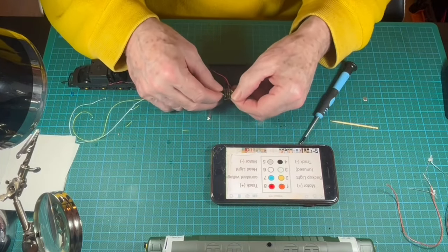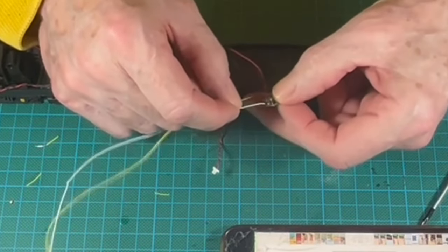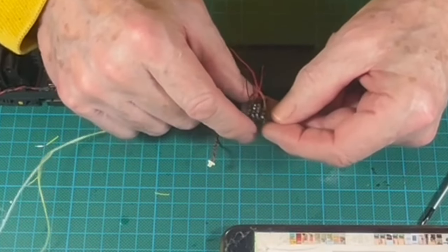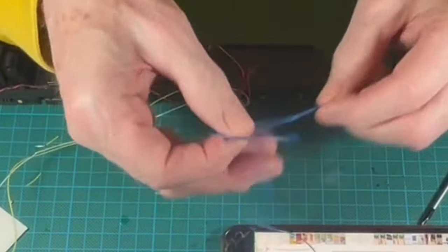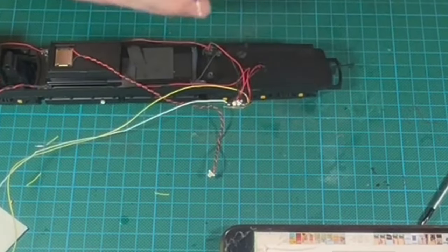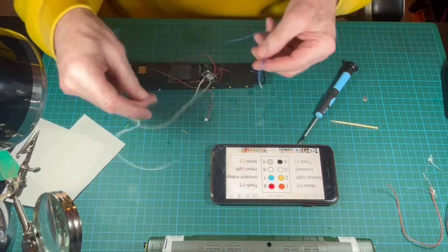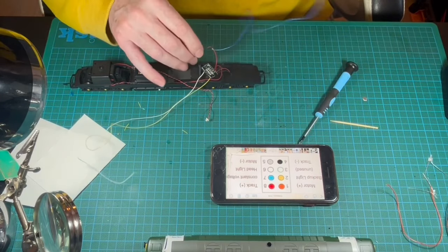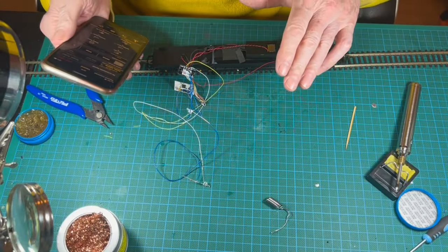Here's what I've done. The white wire is soldered to number six and the yellow wire is soldered to number two. I've also got a pair of blue wires soldered together at one end — these connect to number seven. Then a yellow wire and one of the blues goes to one light, and the white wire and the other blue go to the other light. The next bit of soldering is connecting this wire on. It's a bit of a dog's breakfast of wiring — just completely rough-wired to two lights to see if it actually works directionally.